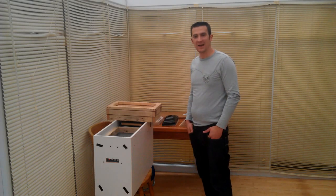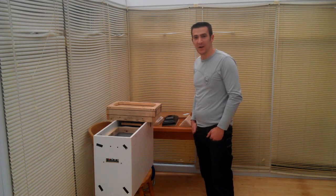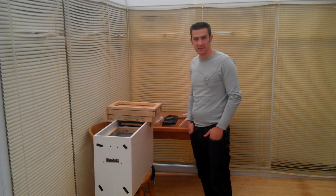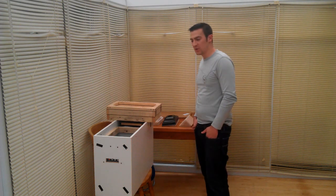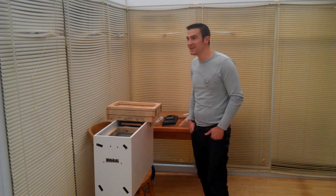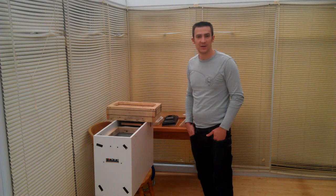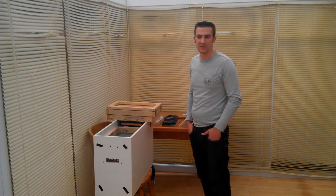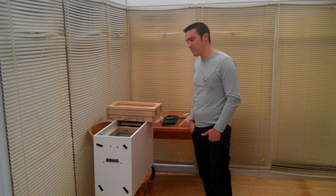Welcome to my YouTube video about DIY vacuum forming. Vacuum forming is a relatively simple science. We heat up a sheet of plastic until it becomes elastic, then drape it over a mould and use vacuum to create a pressure differential across the two sides of the material, forcing it to follow the shape of the mould.